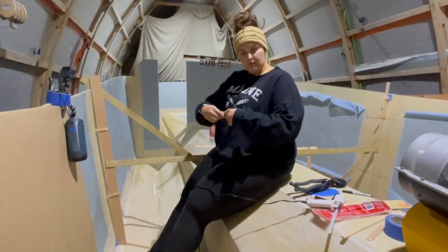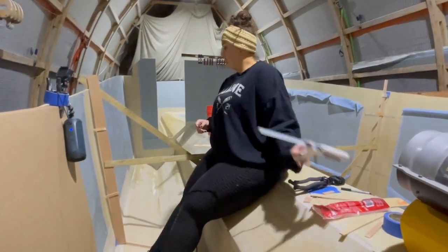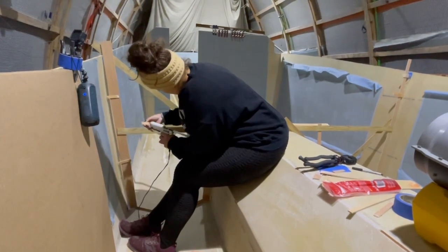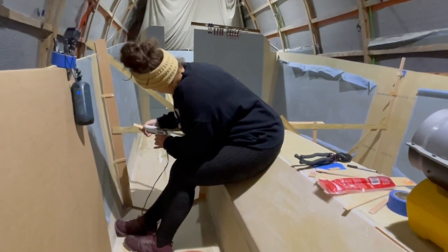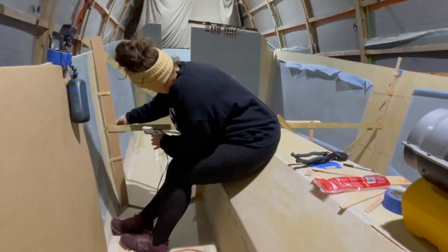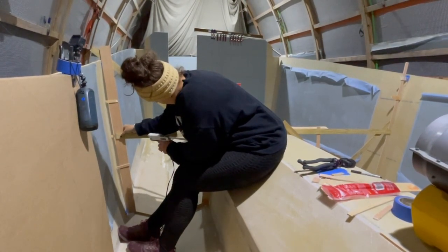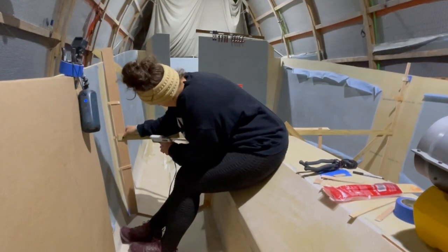As long as you have enough points where we can run that curved piece, and we can get it to match. Now we're going to try to push a lot of that in when we glue, but I mentioned it to the builder, and he recommended just kind of splitting the difference on it. So right now that gap's probably 3/4 of an inch in the middle. So basically what we would do is push it into about 3/8, and again, we'll make that curve on the panel as well, where it's like a 3/8 inch curve.